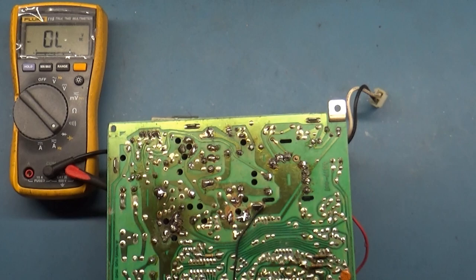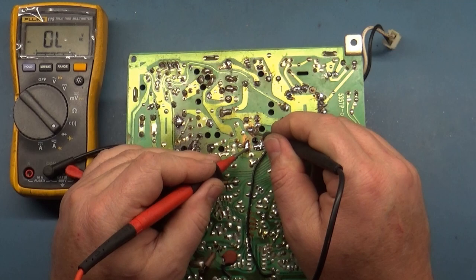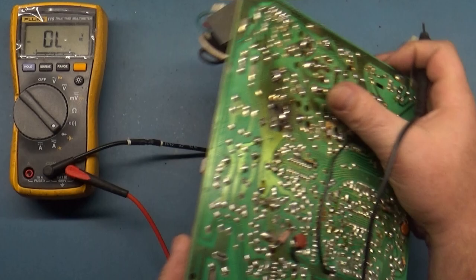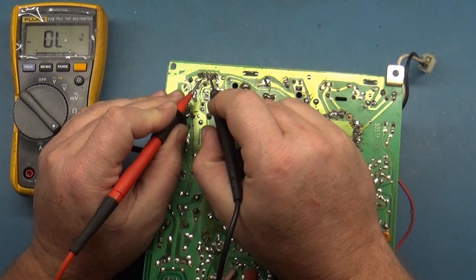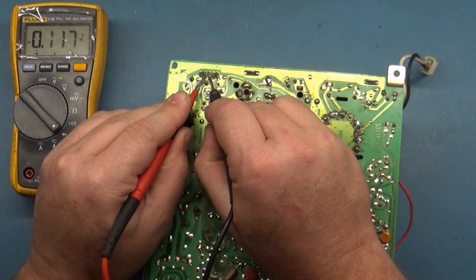All right, HOT time. That is this one to here. Shorted. And our voltage regulator on this, the tall type, not the wide type. There's a wide type and a tall type. Tall type should be pins 3 and 4. Not that it matters if it's shorted, but negative to pin 3, positive to pin 4 on the diode checker. And it's good. Look at that. Well, I don't say good, but it's not shorted.